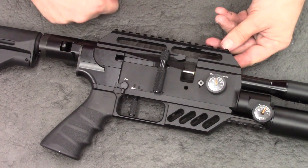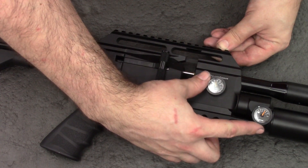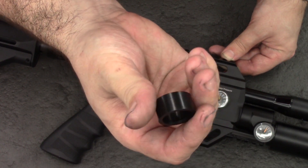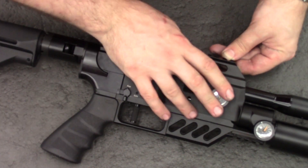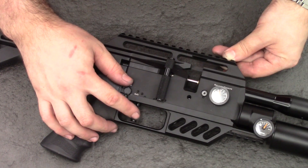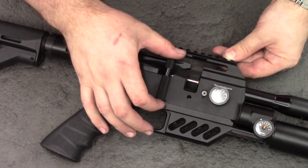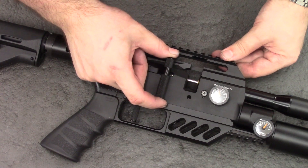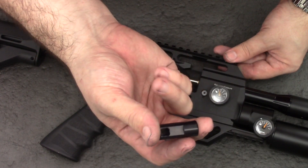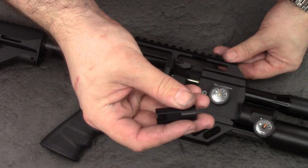Before you go, I just want to point out a couple of things on the rifle that I'm currently selling on eBay. That would be the gauge covers — both the front and the rear gauge — for the little chrome bezel gauges. The covers are nice machined delrin and they fit over the gauges, a nice press fit: nice and tight, they're not going to fall off, but if you need to get them off you can. The other thing is the trigger — it's a pole trigger, so this part rotates, and it feels a little nicer in my opinion. The cocking handles are also available from Bagnall and Kirkwood — I make them and supply them there. And finally, the hammer spring shuttles with a delrin insert in the end — I'll be putting those on eBay either today or within the next couple of days, so have a look out for them.